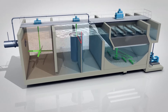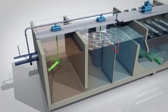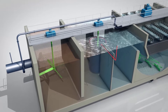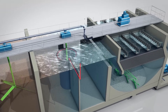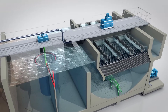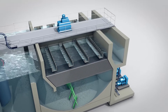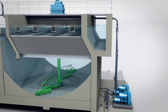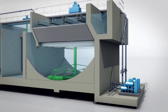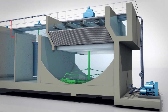Multiflow is used to make surface water drinkable, as well as to apply primary and tertiary treatment to urban residual wastewater, to treat rainwater, to soften water, and in numerous industrial applications — whether to make process water or to treat residual industrial water. Depending on the type of raw water and the treatment goals, the rise rates in the decanter are in the 10 to 25 meters per hour range. These rates may rise to 35 meters per hour in some applications, such as for softening treatment.